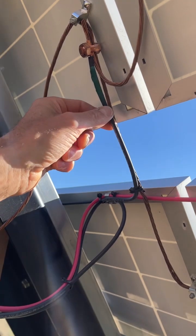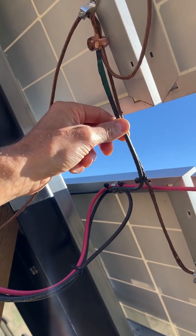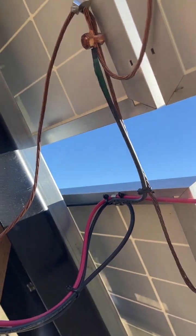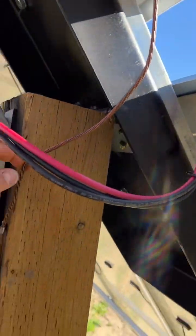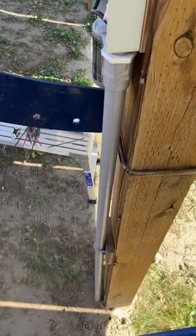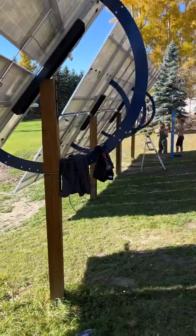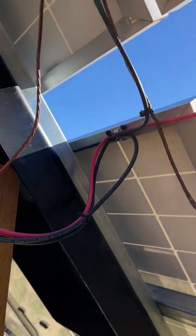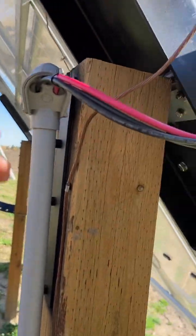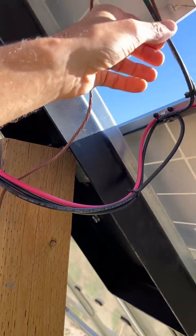Then we have my communication ground that will go into the charge controller's ground mount, connected at the same point. This is coming down — that will take the lightning down and away into the ground rod. Each of the arrays has that on them, and because they're far enough away there's no ground loop between ground rods.